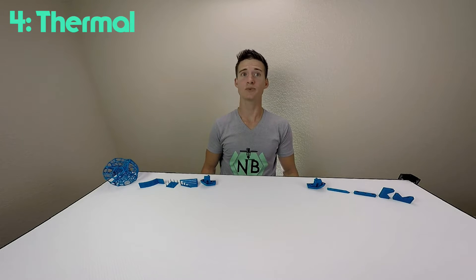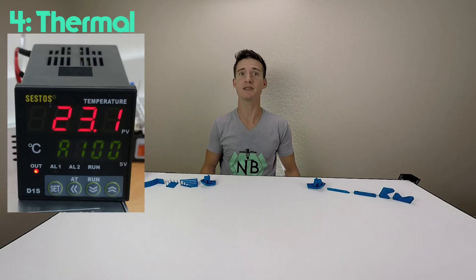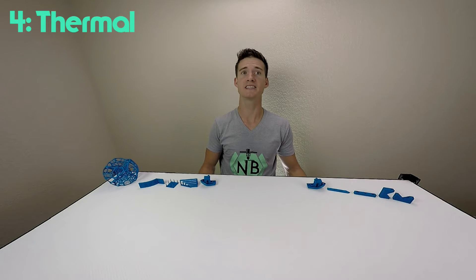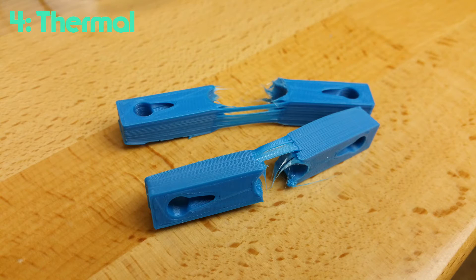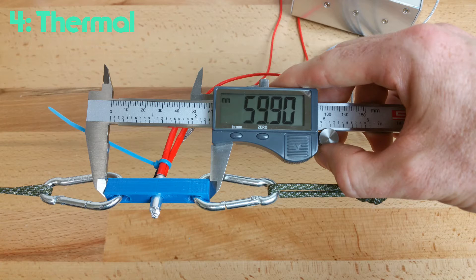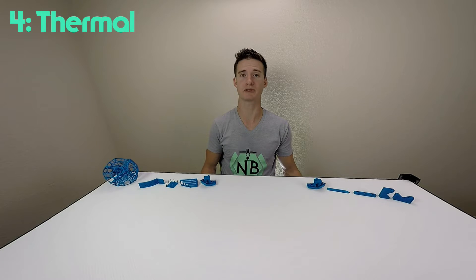The stiffness test will give us deflection versus force of a print held in a vice, measured against a protractor. The thermal stability test is one of my more complicated tests and uses a temperature controller along with a hot end heater cartridge and a thermocouple to subject the printed piece to varying temperatures. The print is put in tension so when the glass transition temperature is hit, the print will begin to stretch apart. I'll be moving up in increments of 5 degrees Celsius, holding for 2 minutes, and then measuring for stretch before increasing the temperature again.